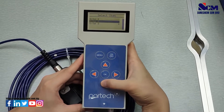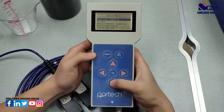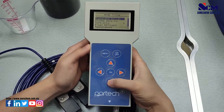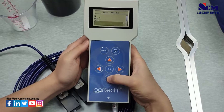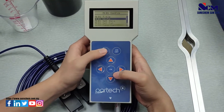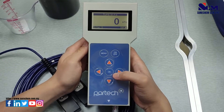Moving on to select the site. This step will teach you how to set the title and unit for turbidity. Go to the menu, then Measurement Configuration, and select title. Select turbidity as the title, then go to units and select NTU. Back in the menu, you will see the units and title are correct.